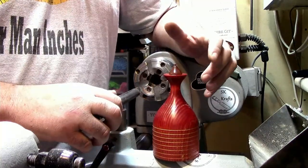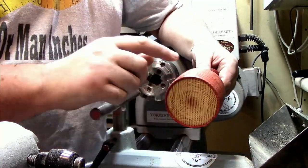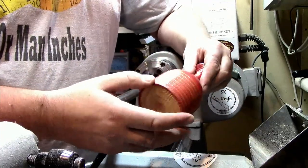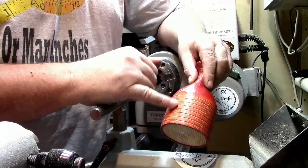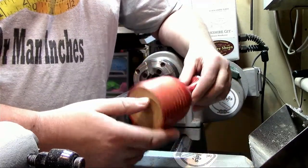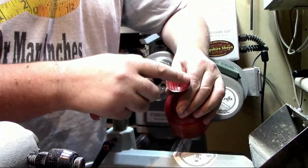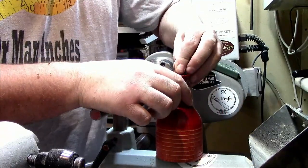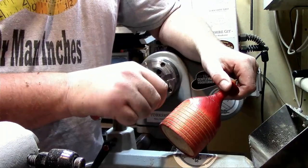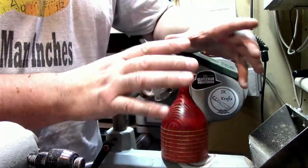This is all from memory from what I saw from Les's demo — it's been over a week now so it's not quite fresh in my head. But I would definitely make it hollowed out a bit thinner — still a bit chunky on the sides, though admittedly that gets rid of a lot of weight. I'd definitely do another one in hardwood, because with softwood you get flat spots when sanding where the soft grain is. I'd make the top piece bigger — it doesn't seem to be in proportion with the rebated bit. That really should be bigger, or the other part smaller. But other than that I'm happy with it. We used the Flame Red Intrinsic and the Gold Embellishing Wax, both by Hampshire Sheen, and did a little bit of texture in the bottom.